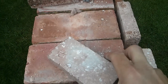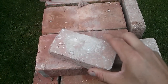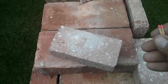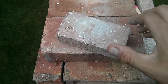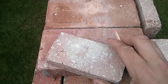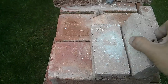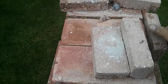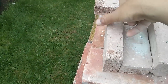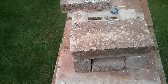A quick test of my vermiculite fire bricks. They're made out of 12 parts vermiculite, 4 parts building sand, 2 parts cement, and 3 parts water — by volume, not weight. Built a small furnace. This is the third video, third attempt at this. I'll actually find some proper aluminium from an old heatsink to try and see if I can melt it.